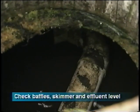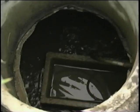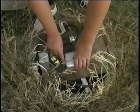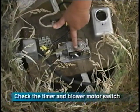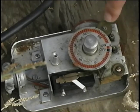The water level should be halfway up in the elbow and at the bottom of the outlet — if it's higher, the system is not draining properly. Be sure the timer is working and set to appropriate on-off cycles; a good rule of thumb is eight to ten minutes of run time per half hour. Watch and listen as Becky, a trained inspector, shows how to manually trip the switch to be sure that it is working.